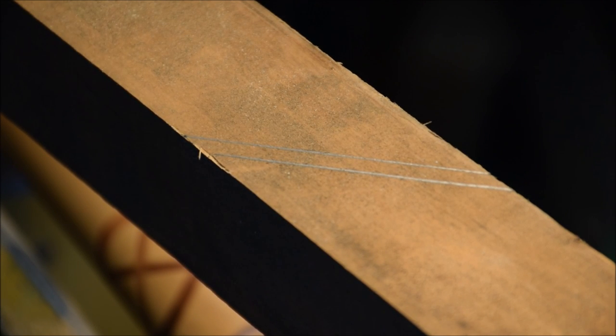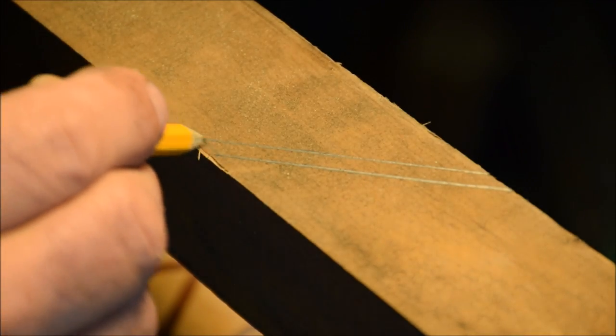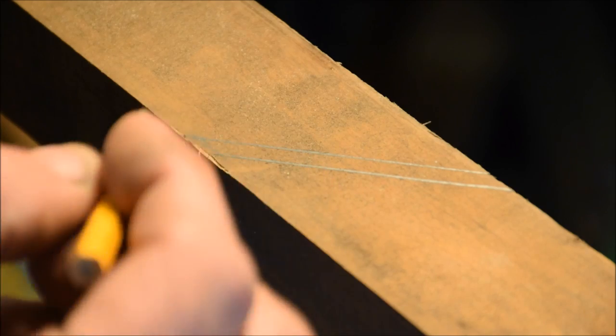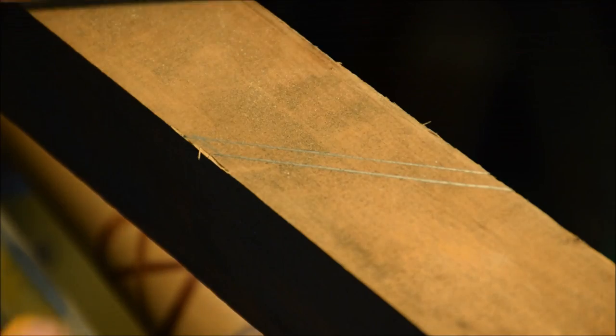What I wanted to show you here is how I went about creating this Celtic Knot. Last time I did this, I made my cuts on my bandsaw — a bandsaw kerf cut with a secondary cut, leaving a little bit left at the edge of the board to make it easier to glue up and continue doing the cut. But then I started thinking: if I'm not in a hurry, I could prep one of these on my chop saw. These two lines here represent the thickness of this piece of wood which I would be laying into this board.